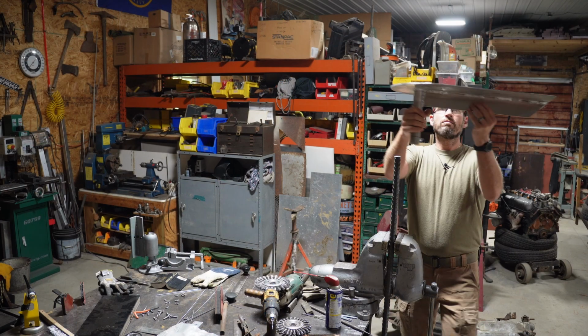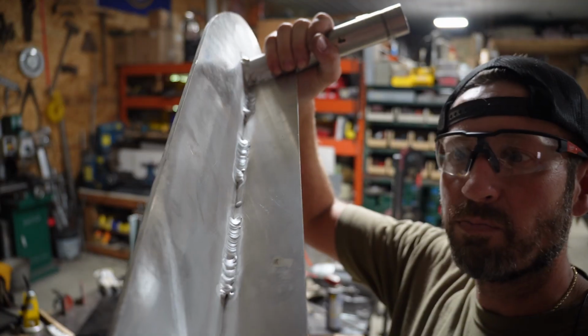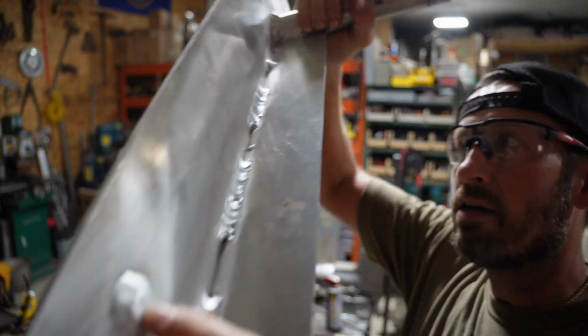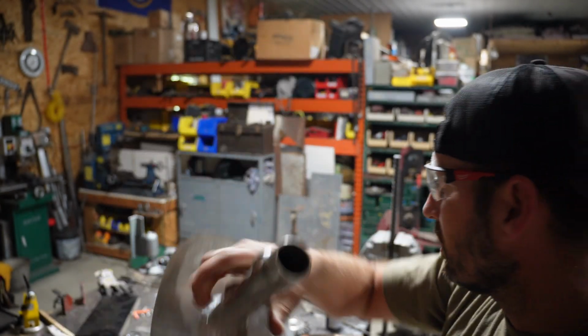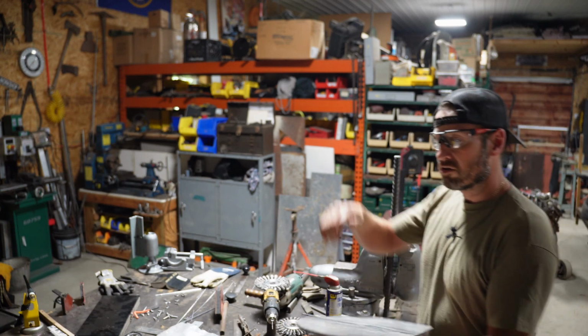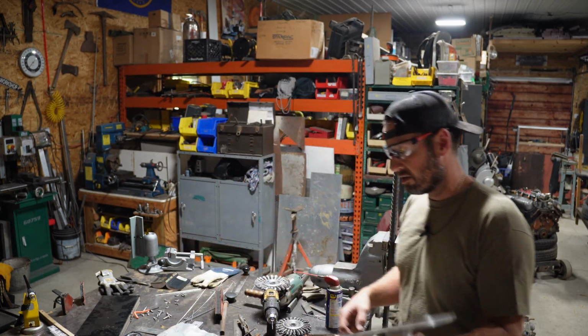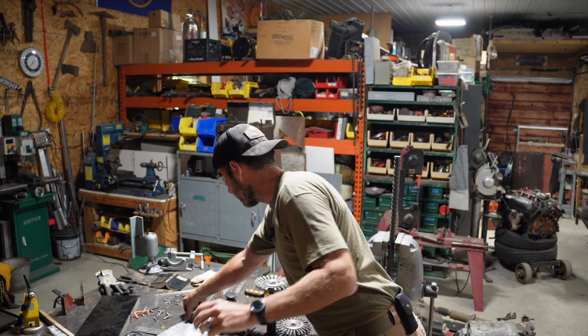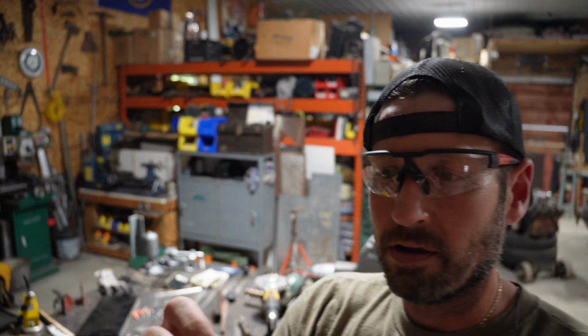And then I'm gonna do the same thing with this upper plate. I built up on both plates a little spot here and up here, where I'm gonna do the same thing, drill and tap 1/4-20. And then on the sprinklers, I'll just drill a 1/4 inch hole through it and set the screws through there. Now the other thing I'm looking at, I couldn't find any 1/4x20 stainless wing bolts.